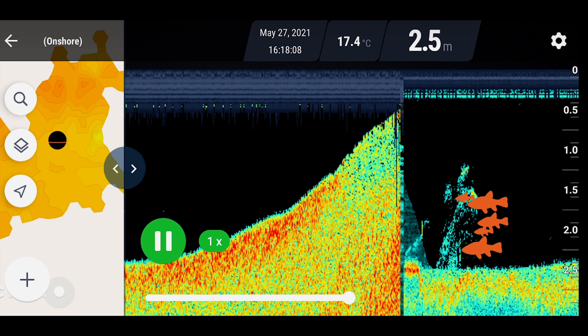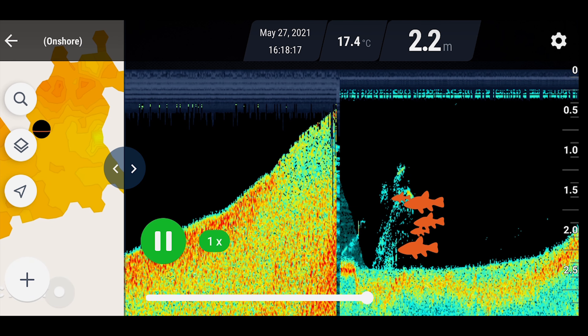Before we get into the app, let's quickly chat about Chirp technology. Chirp sonar is different to regular sonar. To quickly summarize: normal sonar sends out one short ping in a single frequency, while Chirp sonar — which stands for Compressed High Intensity Radiated Pulse — sends out a varied frequency, longer duration ping. The benefits are that the sonar penetrates the water better and sends back more information with better target separation. The Deeper Chirp Plus 2 can differentiate between two targets down to one centimeter apart, so instead of just seeing a ball of noise, you can distinguish individual branches or individual fish.